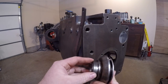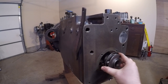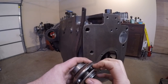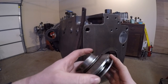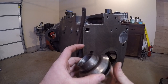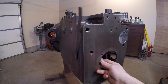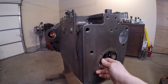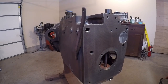As I said in one of the earlier videos, it's a centrifugal ball unit. It mounts to the front of the crankshaft in this opening right here, and it's pretty simple in how it works. As engine RPM increases, centrifugal force acts upon the steel balls, pulling them out against the tapered portion of this inner race, which causes the entire back half of the cartridge to drift to the rear, at which point the shouldered portion of this thrust-bearing race acts upon the governor fork, and when the governor fork moves it also manipulates the external lever, just like happens on a production 445 tractor.